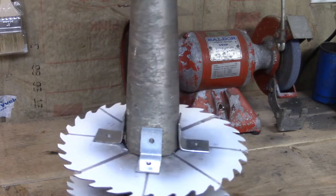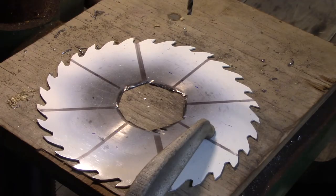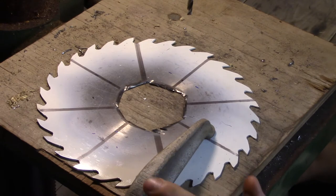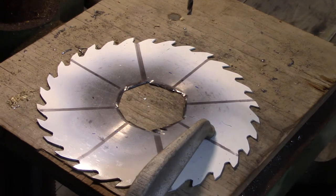Now line up the brackets on the bat so you can mark out where you want to drill the holes. And now just drill through all the dots you marked out. And remember to use a liberal amount of oil. And please, please clamp your work down when you're using a drill press, if you're using a drill press.